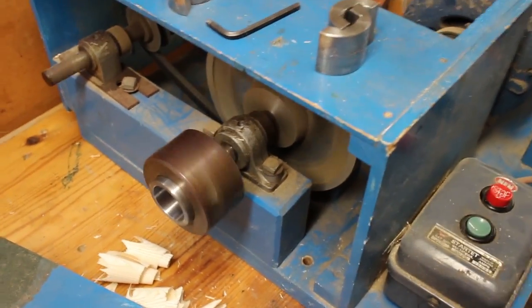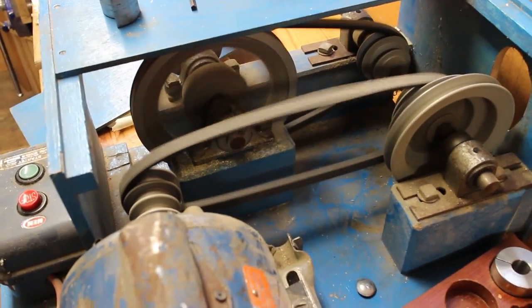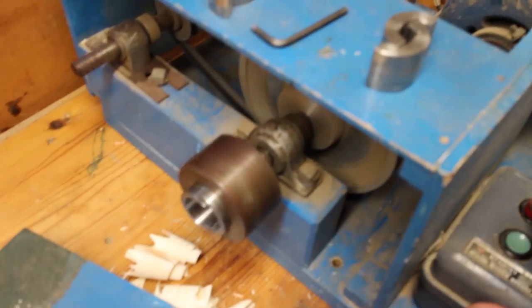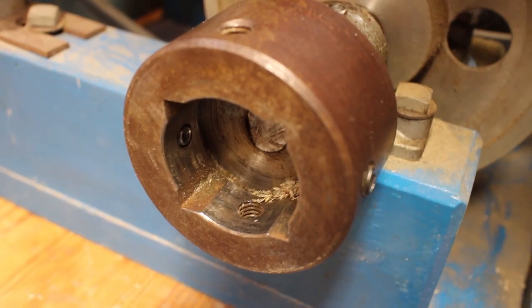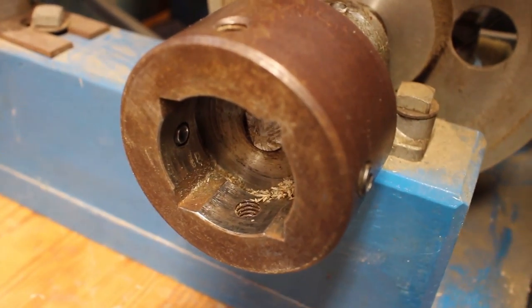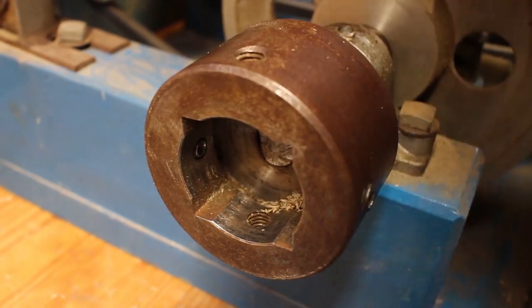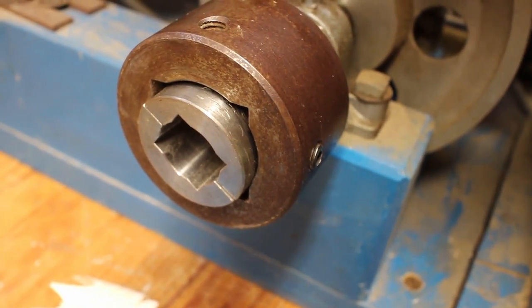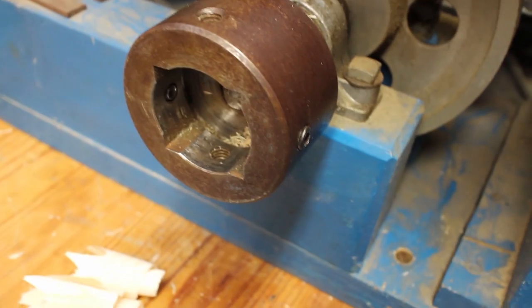Let's give a quick demo — there we are, that's it in action. It's a nice quiet induction motor, not too noisy. That clicking is the chuck — I haven't taken the bits out of the chuck. The chuck itself can be knocked up on a metalworking lathe and it essentially just takes collets, so you have different little collets to match the different tool sizes.